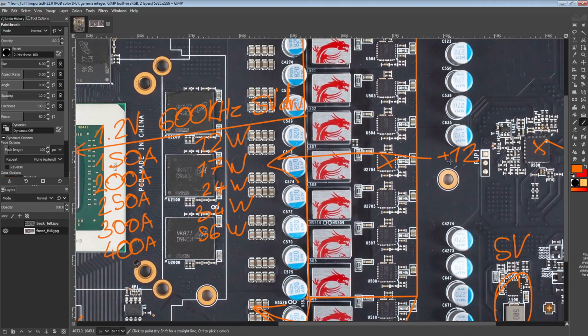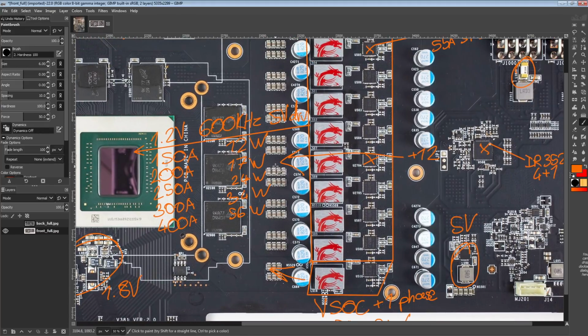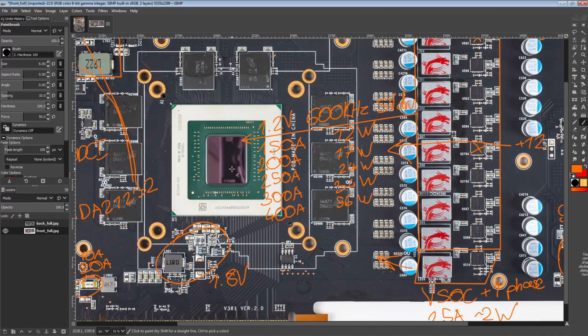The problem with this short circuit right here is that your GPU core, if it's exposed to like 2 to 3 volts for even a couple milliseconds, it's going to be very dead. Or microseconds. It really doesn't take long. If you exceed the maximum voltage allowable for the silicon for a very short period of time, bye-bye silicon.